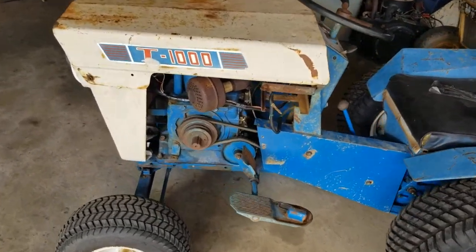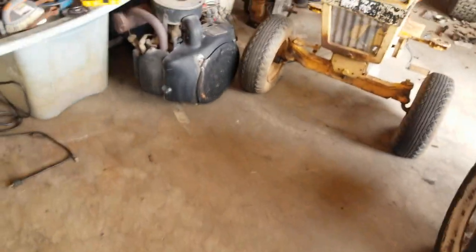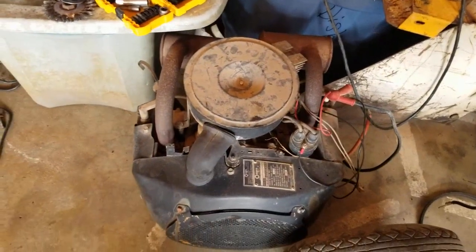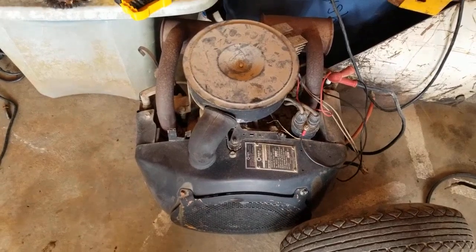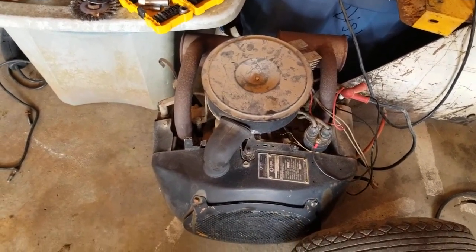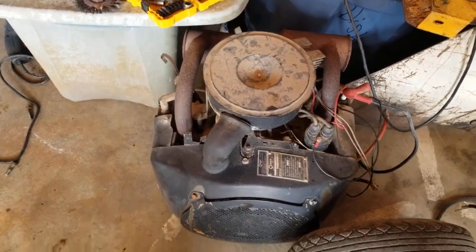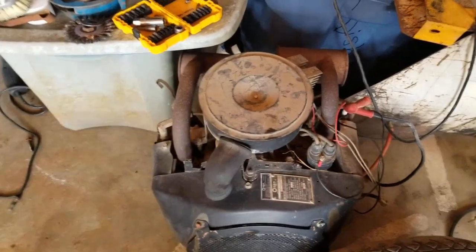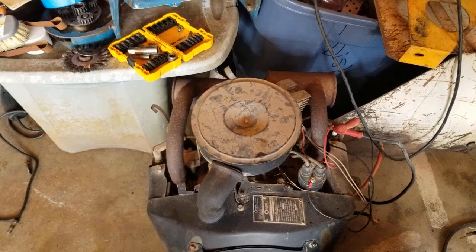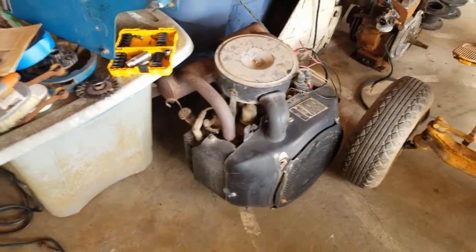I think my next video or two, I'm gonna be working on this Onan. It came out of a 78 Sears. It's a B48M. I had it running. It's got a really good compression. I'm going to go over compression checks. I'm going to refresh the tins. I'm going to put new plugs, new wire, new carb kit, new, you know, make it really nice and throw it on the shelf.